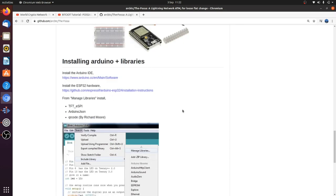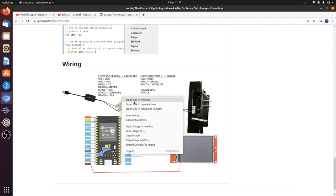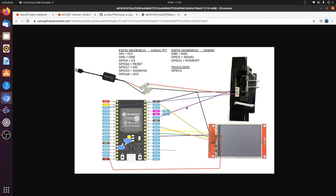There's some info on installing the Arduino IDE. Let's have a look at the wiring. The coin mechanism has a 12V power feed coming from a 5V to 12V step-up converter. This USB in the ATM is going to be plugged into that extension, and the ESP32 is also going to be plugged into that extension — so the ESP32 gets 5V, but for the coin mech we step it up to 12V.